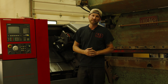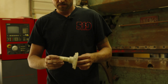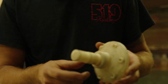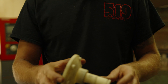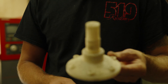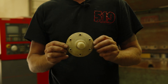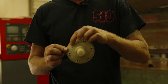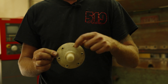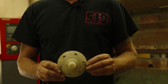Ultimately what I intend on making is this little thing here — this is an axle adapter, just a 3D print designed here. This adapts a Porsche CV shaft to a Lexus drive for a little electric project I've had cooking in the back of my mind for a while. You can see the importance of the live tooling — it will drill all these off-center holes in the round part in essentially one operation in that machine.